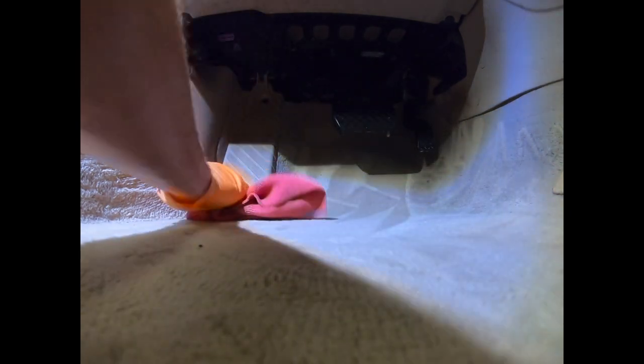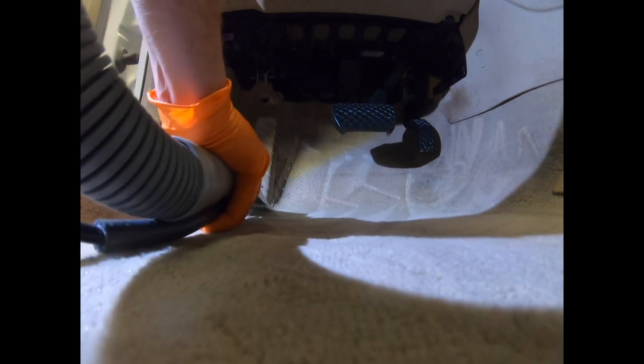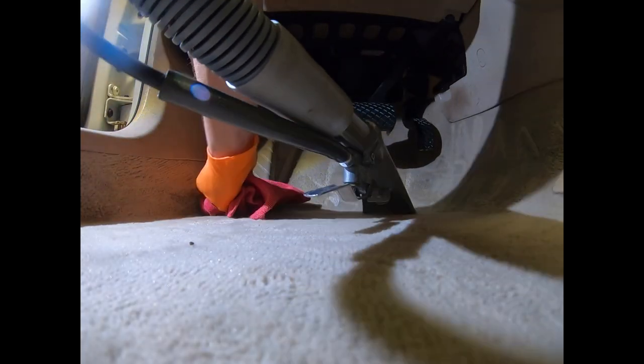You never remove all the residue from carpets — even professional carpet cleaners don't. I don't want to go there, but sometimes you just need chemicals to get the job done, and then hopefully you leave it without much chemical residue by cleaning it the right way. I'll mop it up with a towel and keep extracting. I'm trying to hot water extract every square inch of this carpet. If I'm seeing stuff left over, I'll hit it with NCAP Spot, re-agitate it, and use the tamping method — put the towel down on the carpet, slam down on the microfiber, and hopefully extract some of that into the towel.